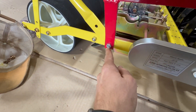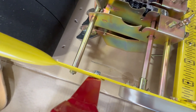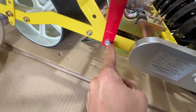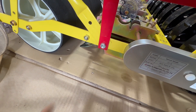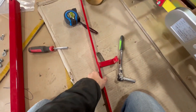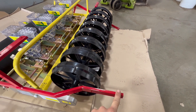I've kind of got the sides on. There's a bushing in there and I had to use a vice to get it through the hole, but there's supposed to be a washer in between the red thing and the yellow thing, and another washer there. So I think tomorrow I'm going to have to go get a longer bolt so I can get those washers on. It seems fully threaded on but I'd really like a little more thread coming out. Next step is putting this bar on top, because when we connect the three-point it'll lift it up.